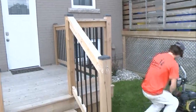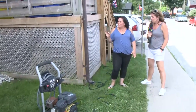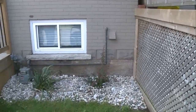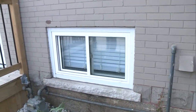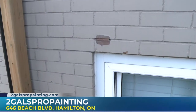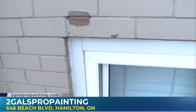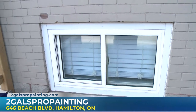So what's next after that? After we pressure wash, then any blemishes and imperfections in the brick that we want to fix, we want to do that. So if there's holes — maybe you had a garden hose that you took down off the wall — we want to fill those holes. Or maybe there's some little gaps or cracks in the brick where the mortar's fallen out over the years. We want to fill that. We want to caulk around window frames and all of that kind of stuff. That's going to be the next prep before we actually apply the paint.